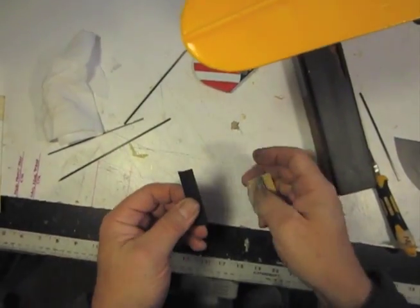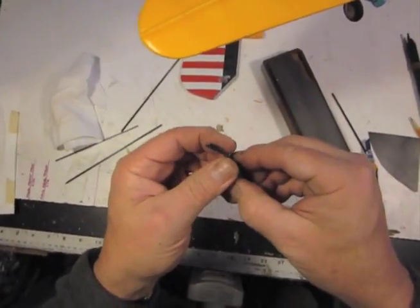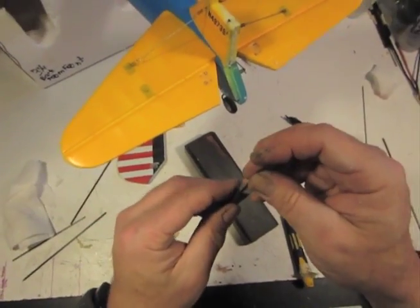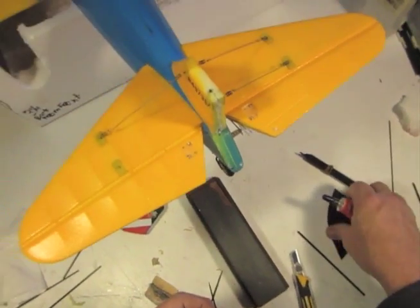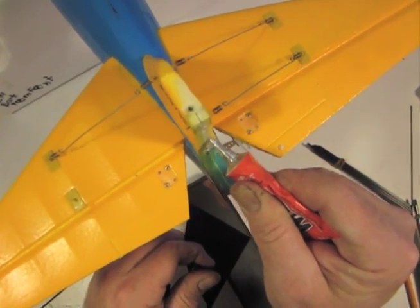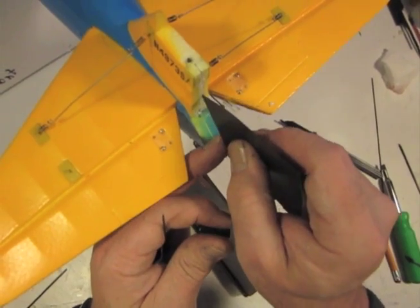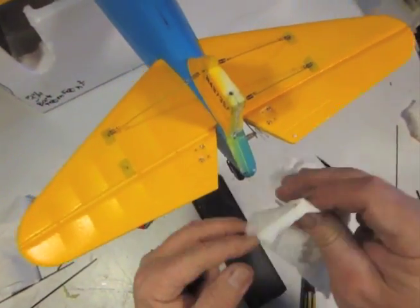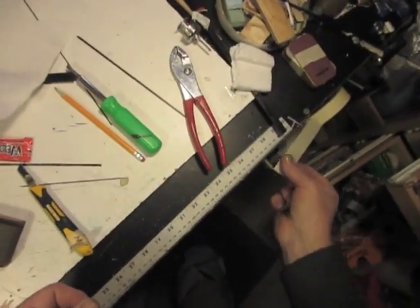Remember — put a tooth on it, put a head on that. Name that film! That's Public Enemy. Now we have it folded at a 90-degree angle with our spacer. What I normally do is use a rod or a piece of HDPE to work the glue into the slit. Put some glue right where the edge of the slit is, then push it in using a thin tool — slide it over, push it in, slide it over, push it in. Immediately wipe off the excess; we don't want a bunch of excess glue on our surface.